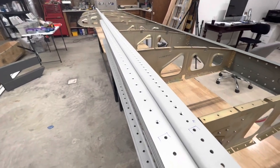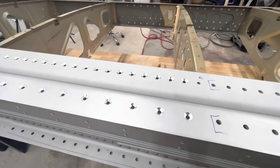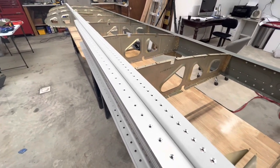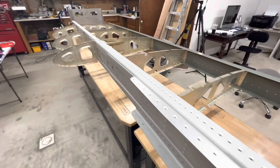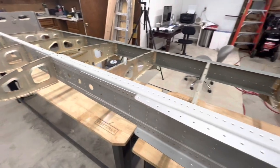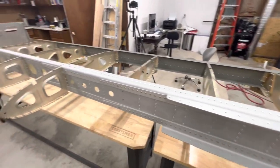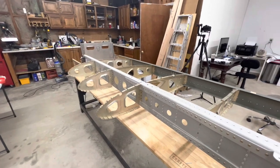Countersinking these was not difficult, but it was stressful getting started — trying to get my little tool set to achieve just the right depth, which is really hard to measure with the tools I had. I think it turned out pretty good. I did a lot of test countersinking on scrap material to make sure I was happy before I started working on what I'm sure is a very expensive part. Anyway, that's the wing, and I'll be working on the skins today.